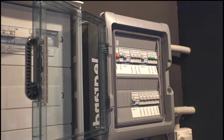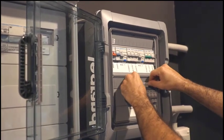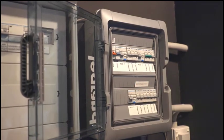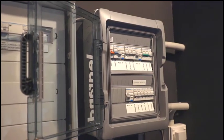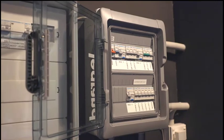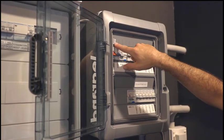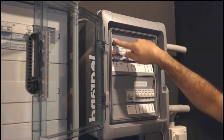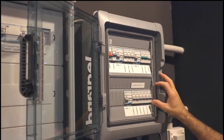And here we have all the dedicated, isolated backup circuits. Now the previous grid supply, that labelling is optional whether you remove that or not. It is technically still the grid supply, but it could just now be labelled as the supply for this subboard.